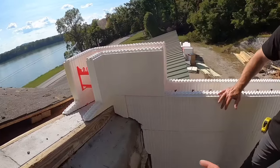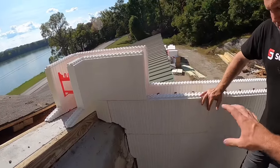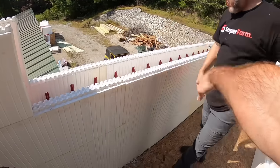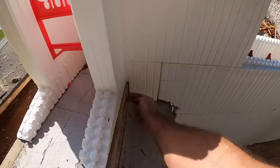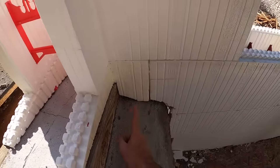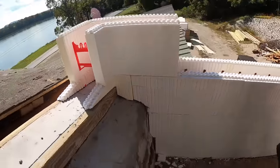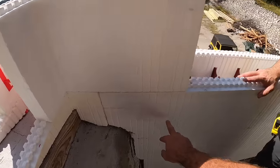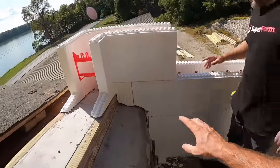Yeah, so my thought process there is I know this corner is suspect anyway. I would just throw a 2x6 way out here in no man's land all the way over and bump this wood, toenail it in, and screw it to that stud. Yep, and that would capture all of that. Screw it to this stud, screw it to that stud, and that would tighten it all up.